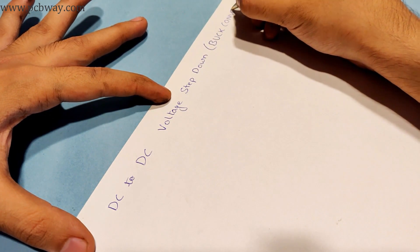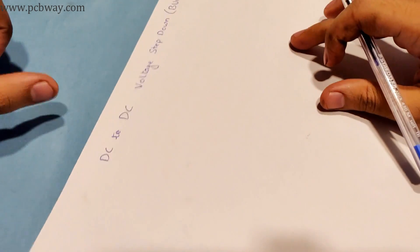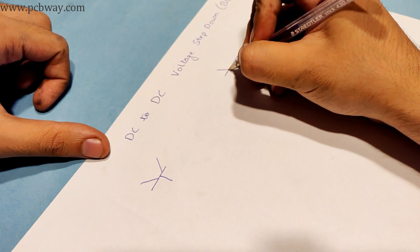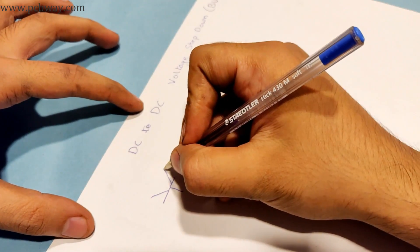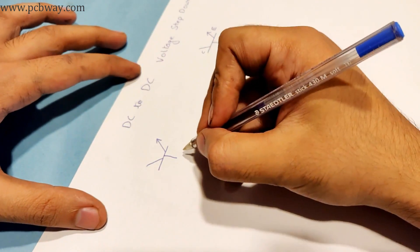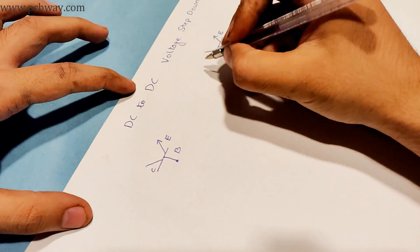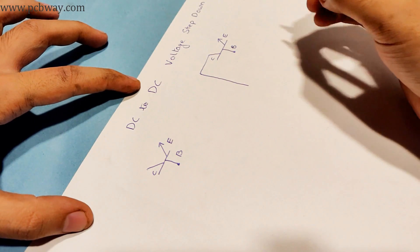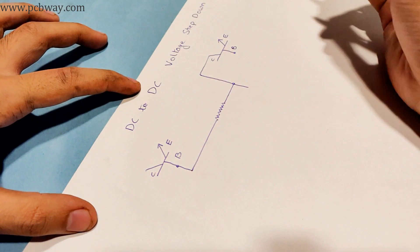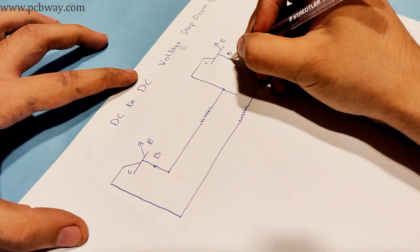The technical names for a step-down converter are buck converter or step-down chopper. The worst buck converters are those that not only decrease the voltage but also the current. In this project I will make the simplest possible converter that steps down the voltage as required but steps up the current, thereby making it a low voltage high current output converter. The circuit diagram and the components used in this project are identical to the step-up converter project. I will tell you the changes I made when compared to my previous step-up boost converter circuit, plus the recommended changes you should make for even better performance of this circuit.